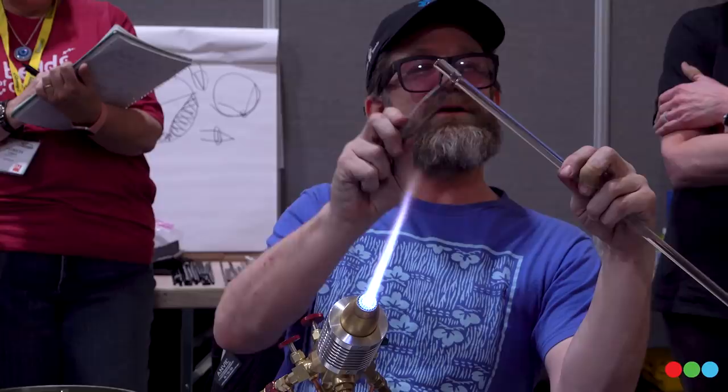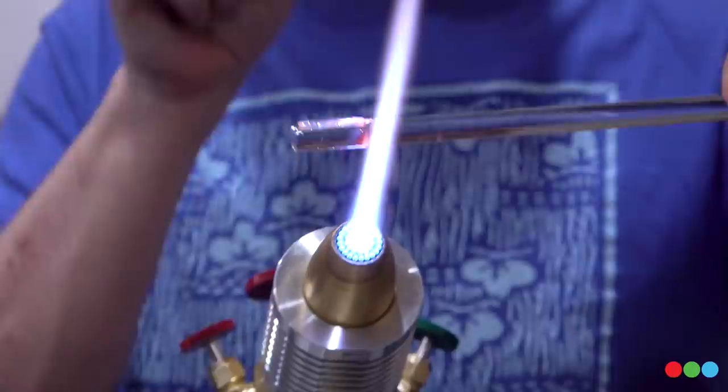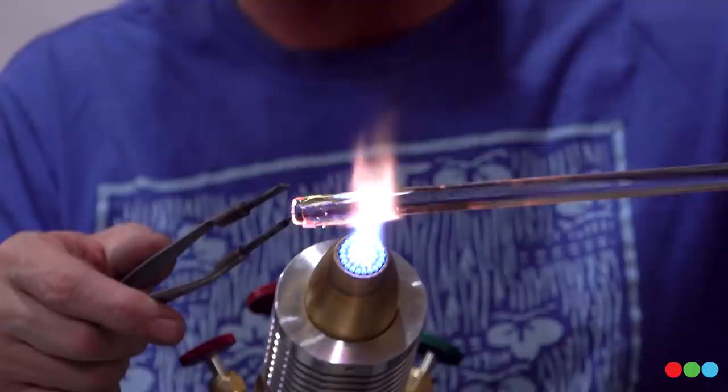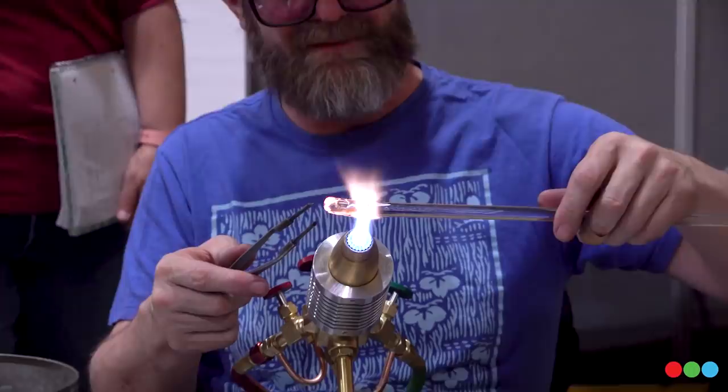If you get this too hot, all of a sudden the last half inch is just as flexible as possible and you have no ability to fold it with control. By putting in this hinge point, I hope that helps you remember to just heat that spot — because that's the only part of the glass we really want to be fluid right now. I want it to fold right there, very specifically, like the hinge on a door.